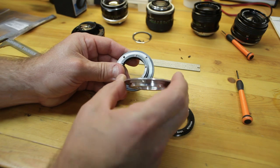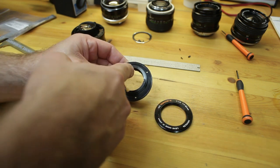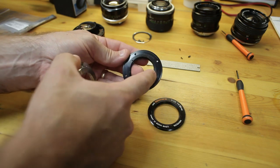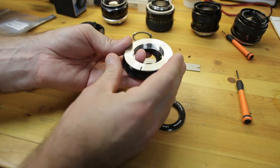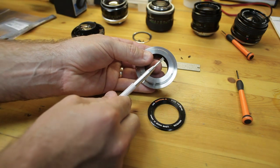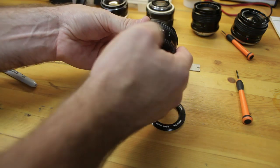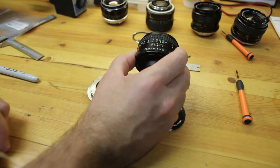The reason we do this marking on the M42 to EOS adapter and the aperture mechanics flange — marked right here — is so that when we go to mark the holes to drill using this as a template, we line this mark up with the mark here, align it, and mark our holes. We use a fine center punch and then drill our holes. That way, when the lens is mounted to the camera, the diamond distance indicator scale will be facing upward at the 12 o'clock position, just like a normal lens.